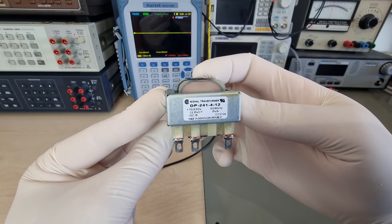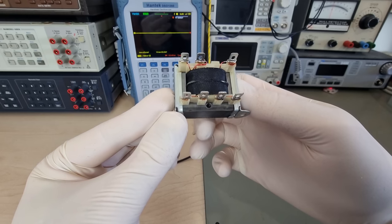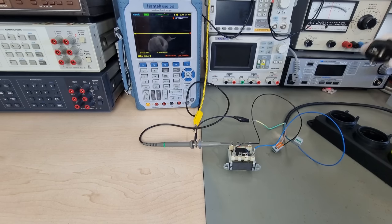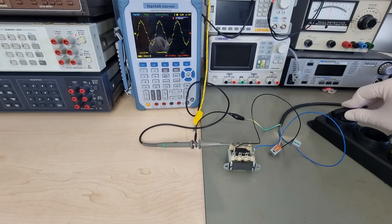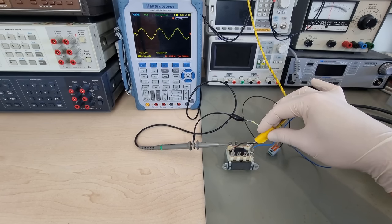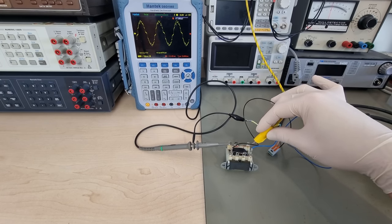This is a small split-bobbin power transformer currently available on DigiKey and inexpensively so. It's got low capacitive coupling mentioned quite prominently in its datasheet — promising. With the windings being separated so nicely, the core capacitance is a much bigger deal of course. So grounding that is highly effective. And that finally gives us a great, unproblematic, low-leakage transformer — cheap, available, and better than the Fluke 732A.